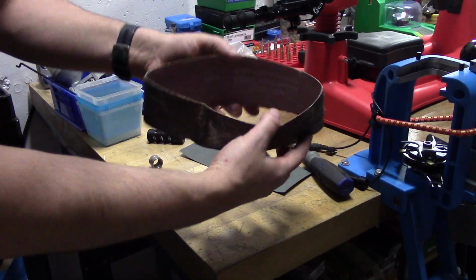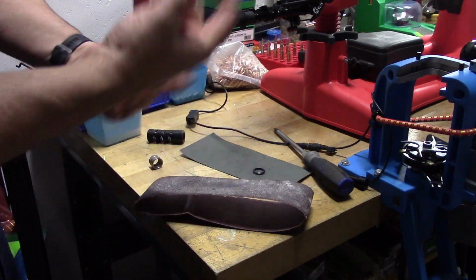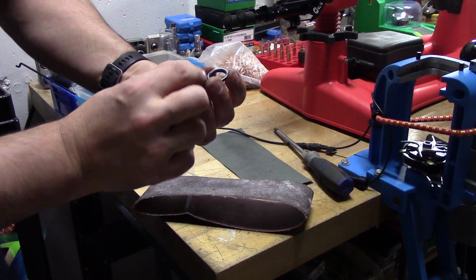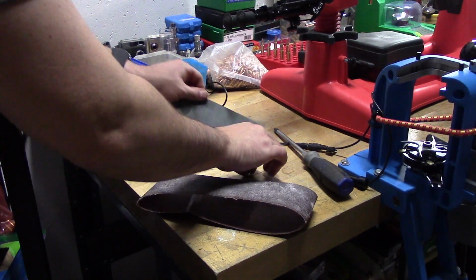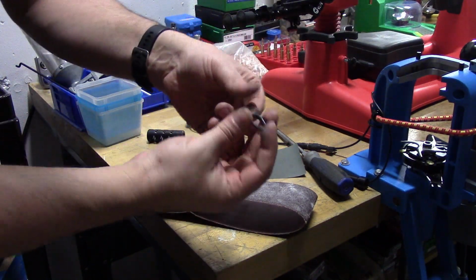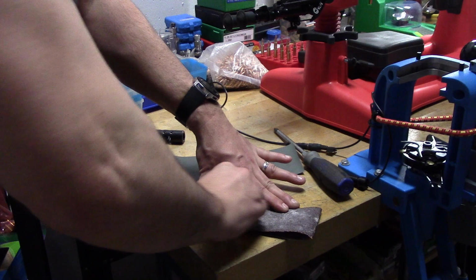In case you're wondering, this sandpaper, I just had it out in the garage. It's pretty aggressive. It's 50 grit sandpaper. It doesn't have to be that. Like 180, I'm sure would work fine, but this is all I had, and it takes away the metal pretty quick. And I like to just come back to this. This is wet sandpaper. I think it's 2000 grit. I'm just doing this to smooth any burrs that may be on it. So I'm just repeating this until it lines up.